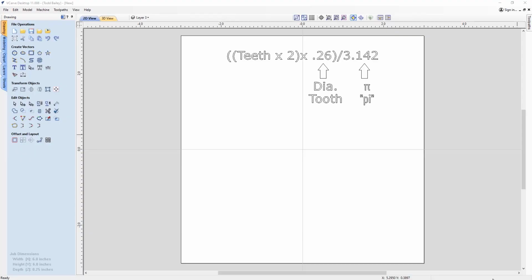So after reading the article, I found out that if I want to make a gear with a certain number of raised positive teeth, then all I need to do is plug in the number of raised teeth I want, and also the diameter of the teeth that I'd like to have. And what's wonderful about this kind of gear is it's based on a circle, which is perfect for a CNC end mill that happens to be round. Now the end mill that I'm going to use to cut this out with is going to be around 1/4 of an inch, so 0.25 inch.